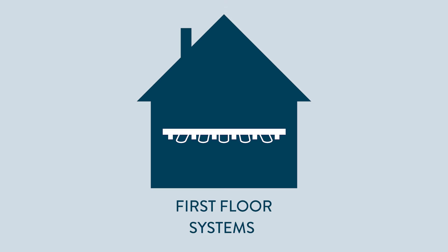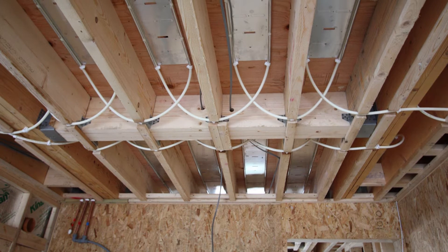Because of its weight, this would usually be a ground floor solution. One of the traditional myths about underfloor heating is that you can't have it upstairs, but this simply isn't true. Thanks to the range of systems available, you absolutely can. The underfloor heating pipework is fitted between the joists of the floor, with metal plates transferring the heat to the floor deck above.